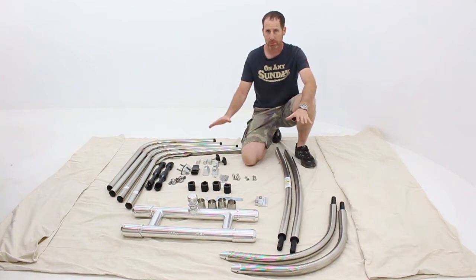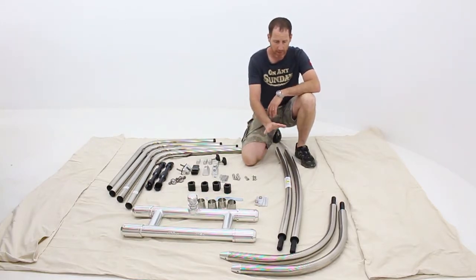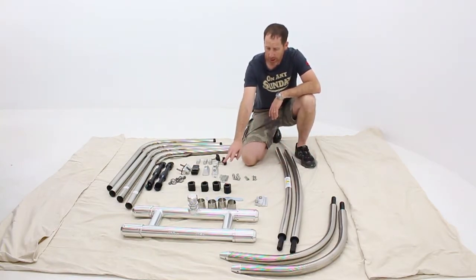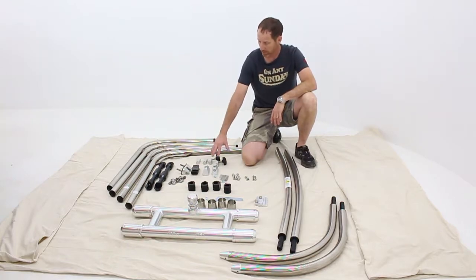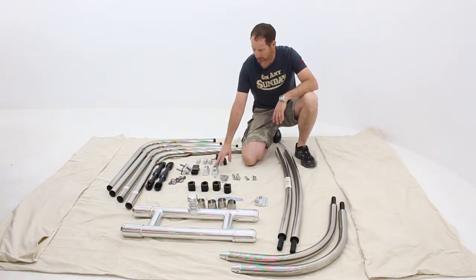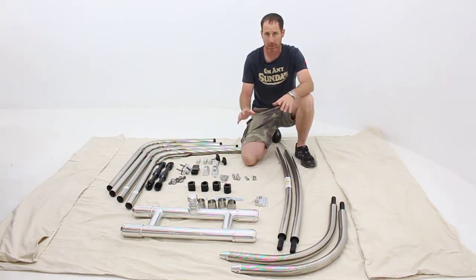All right, we have our Fusion parts all laid out, pre-assembly of the tower. This is basically what you're going to get in your box when you receive it from UPS or your dealer is installing it. You have your front legs, your rear legs, your H-member, collets, backer plates, spanner wrench, front and rear corners. You have your strut system, base plates, minus a couple because we've already put them on the boat. Our swivels here, and miscellaneous hardware there. This is what you're going to get in your box, and this is so you can identify those parts when you begin to assemble the tower.